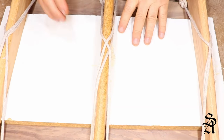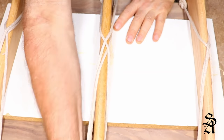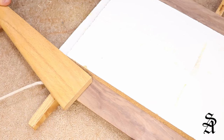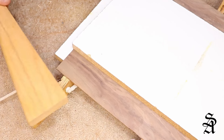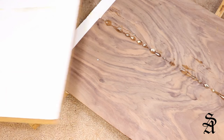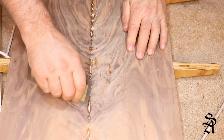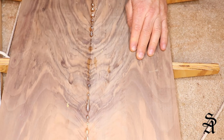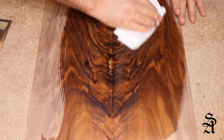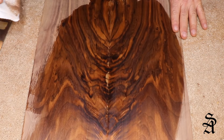After the glue dries we can start removing these wedges, which reduces the pressure and clamping force on the pieces. We can use a little gentle persuasion with some blunt instrument to release our boards. I just use the scraper to get the big stuff off, wipe it down a little bit, and check the alignment of my pieces to make sure everything fit the way I wanted.